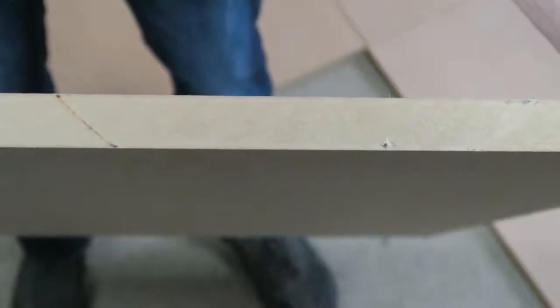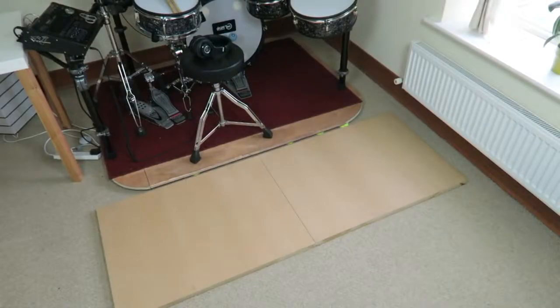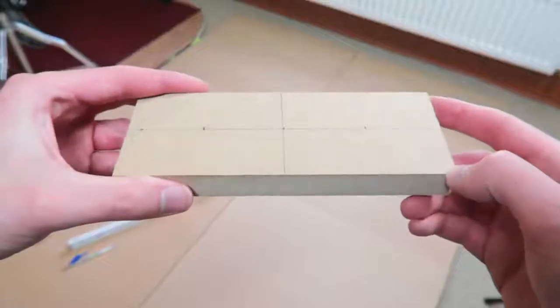The platform material should be at least 19mm strong. However, I went for 24mm MDF sheets and got them cut in the right sizes by the local wood cutting shop. Any other wood material would work too. The blocks used to connect the 4 plates are only 19mm strong.